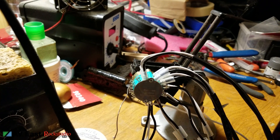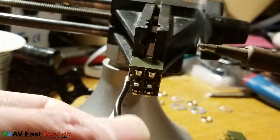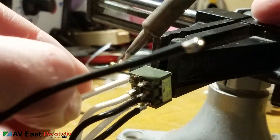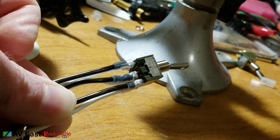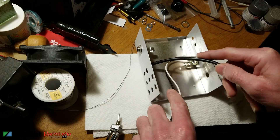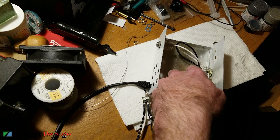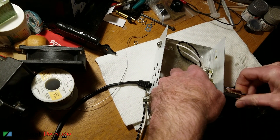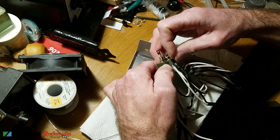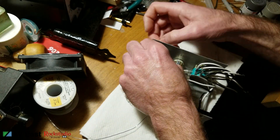I put a little heat shrink tube on there to keep the wires from bending and maybe touching in the future, and here I'm just shrinking up those little bits of heat shrink. You can get that stuff from Redco as well. Then I'm going to wire up the toggle switches — I had to do this for both of them, and I also put some heat shrink tube on there and tightened them up. You're going to need to buy some quarter-inch jacks. I really should have used isolated jacks, but this is sort of a prototype, so you can get those off Redco as well. Now I'm going to mount everything on the box, and I always put a little thread lock on the nuts.